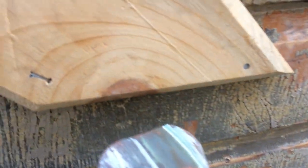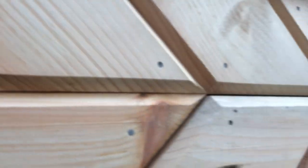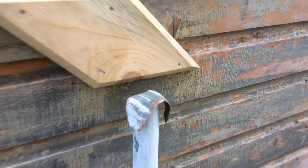The only question is whether it needed to be that high, because the sink is up here. Could water come back through? If that's the case, I'll need to cut this off and put in one of those one-way valve vents. I don't think it's going to do that, but we'll have to keep an eye on it.